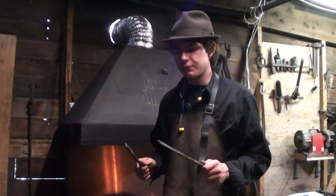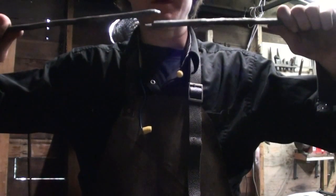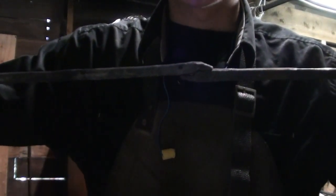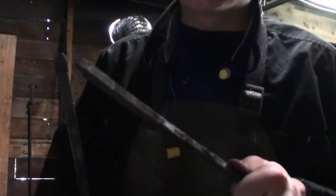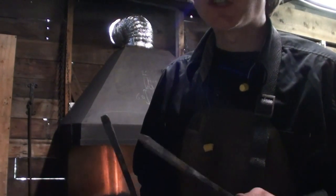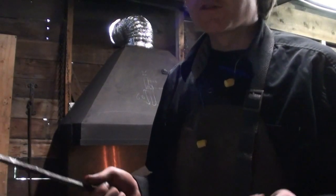Okay, we're almost ready for forge welding, but before we're going to put them in the fire and heat them up and flux them, we first need to clean them — so make sure when we make the bond there's no crap between it, because if there's crap between that, the weld will fail. So it has to be clean. The way you do this is just by filing or grinding and making these parts on the inside a bit round. Because when you make them round, it will flatten out and squeeze out all the crap that's between there. Instead of if you leave them flat, there's a chance it will form a sort of cave and everything will be trapped in it, causing the weld to fail.